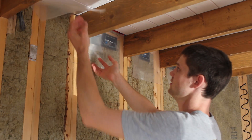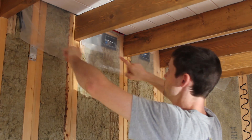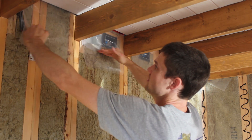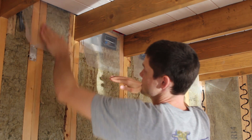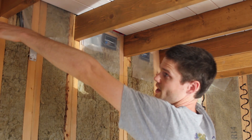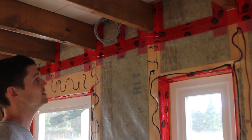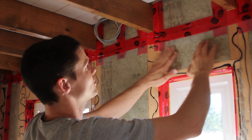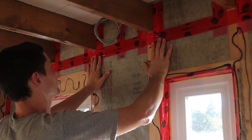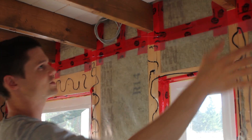Here's what we're left with down here. All I need to do is tape this down and clean it up. When we put the sheet up for this wall, it'll come up to about this line, then tape over so all these flaps connect to it at that level. So we've got an unbroken sheet all the way down. Here's the other side that's already done - you can see the flaps underneath, and the strip of tape connecting the whole piece for this wall to the straps, and the strips taping the flaps down.